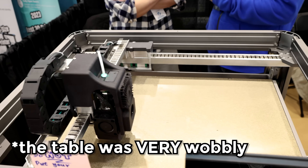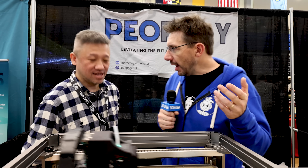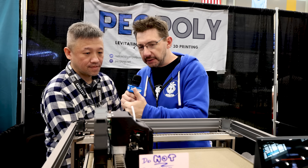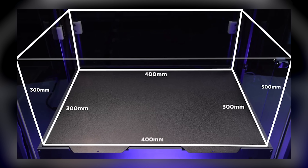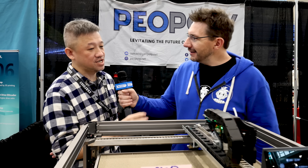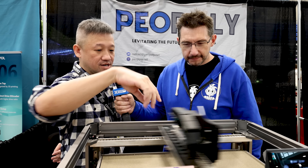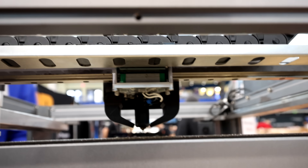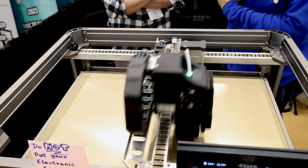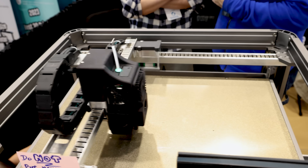It's shaking because it moves so fast. Klipper is going to give you input shaping and allow you to do that rapid development. So we know the software — let's get into the hardware. We've talked about the linear motors and running Klipper. The build volume is 400 by 300 by 300. The reason for that is you can see how one axis is stacked on top of the other, so that axis is handling more load. It actually has a bigger rotor than the other. It makes sense to make it a little bit longer. That's why it's 300 by 400 rather than 300 by 300 or 400 by 400.